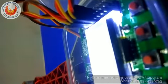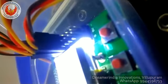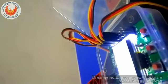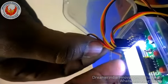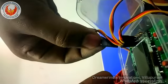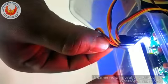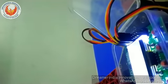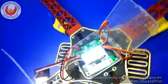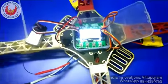I am going to show this in close-up. I am removing the first wire, and you can see the power is turned off. Then I am connecting that first wire again, and you can see the power turns back on. So by removing the first wire of the KK board, you can power off the quadcopter.